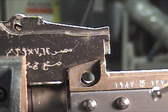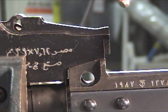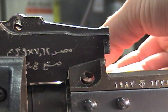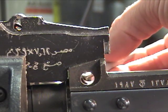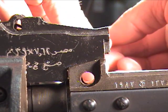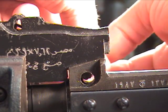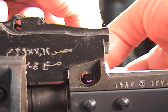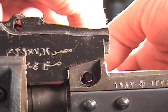The first thing you do is check the hole. You can see the offset from where the barrel went in a little further than it did in the original hole, because this is a non-matching barrel. Expand the gauge in the trunnion section — not on the barrel section — until you feel it just start to drag on the inside.